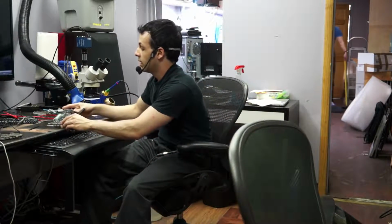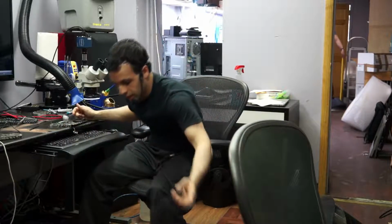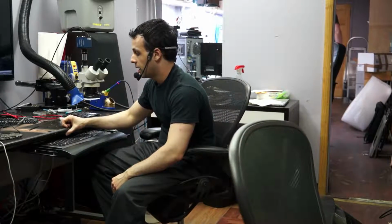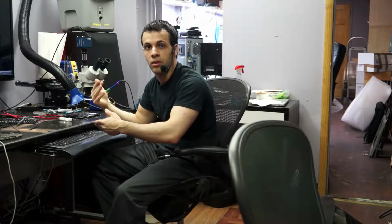Still sick. And that's about that. So that's a basic current sensing problem, a basic ISL problem. It was clearly not soldered, it clearly wasn't resting flat on the board, and you can see how I wound up fixing it. Again, I hot aired it, and I pushed it down, not too hard, just to make sure it was down on the board very clearly.